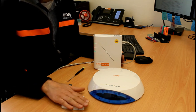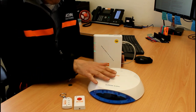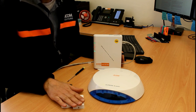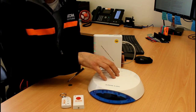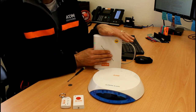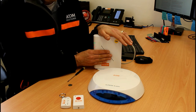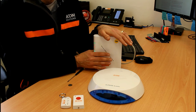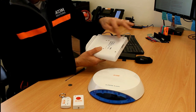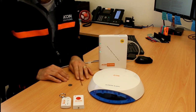Batteries in the duress button, remote, and AV alert should be replaced annually. The button and remote each use CR2032 cells, and the AV alert uses four D-size cells. The main unit has a rechargeable battery pack that should last a couple of years. Contact us when it's time to replace it — it's not an off-the-shelf item. It requires undoing four screws to replace the battery pack inside.